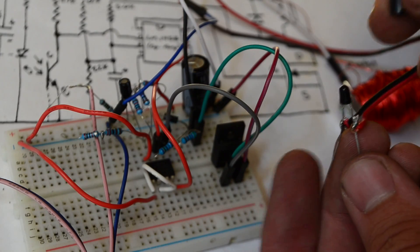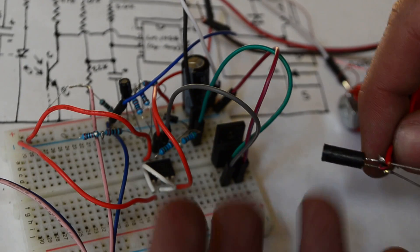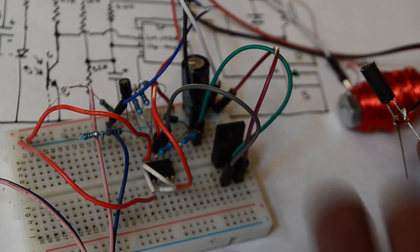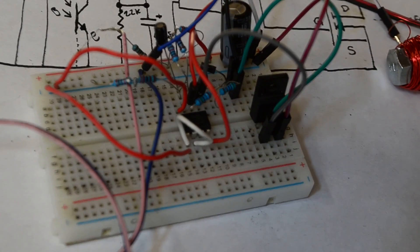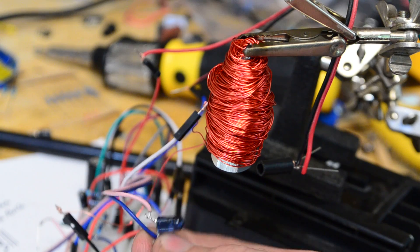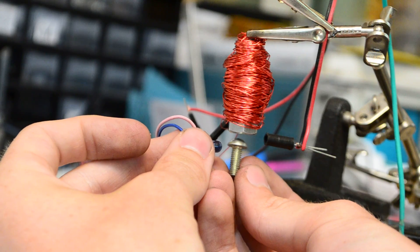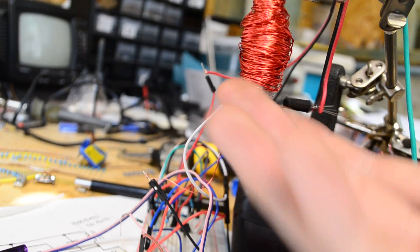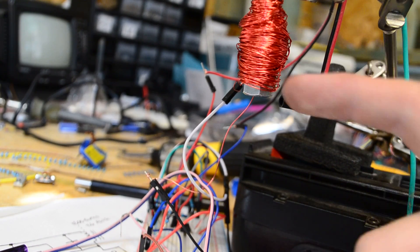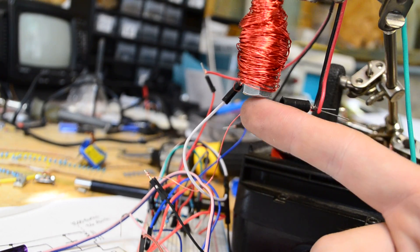The last thing that improves the circuit is to put a tube over the IR sensor. This will help block out IR light that may be reflecting off of things and messing up the process. I'm just using a small plastic tube I found — you could use something like a straw and color it black. With that done, our circuit is now complete. Let's try it out. I now have it all set up. Here's my infrared sensor. My infrared diode I just have over here since I didn't have anything to hold it in place, so I'll hold it with my hand during this first test. As you can see, we can get a metal object to float in midair. We couldn't get it to levitate that high — I originally planned to wrap around 1,200 turns of copper wire, but it turned out I only had enough wire for around 500 turns.